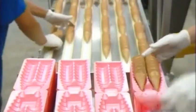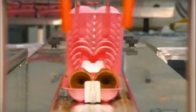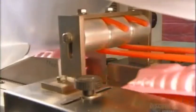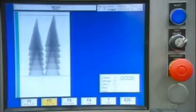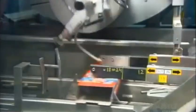Packers stack the cones in styrofoam trays. Then the packages travel through a curtain of high-density polyethylene film. A heated sealer finishes the wrapping job. An x-ray machine sends information about the contents to a computer that counts the cones and alerts the company to any problems. Next, automated arms pick up cartons and open them so the packs of cones can be inserted.